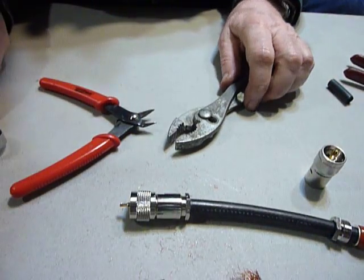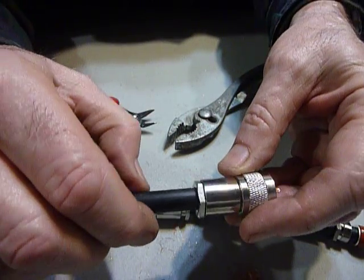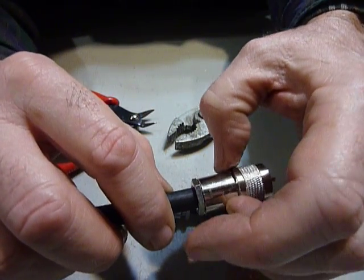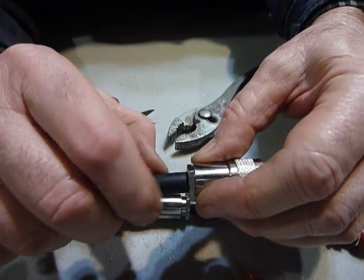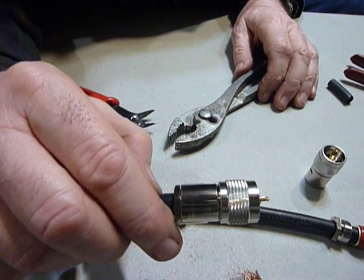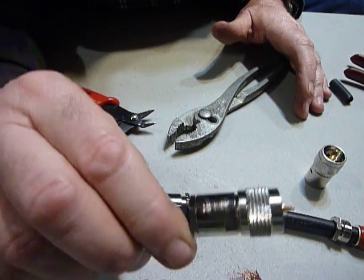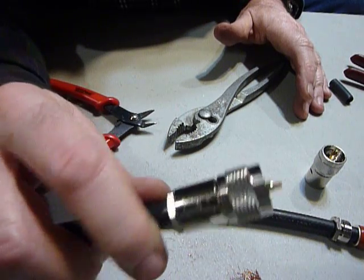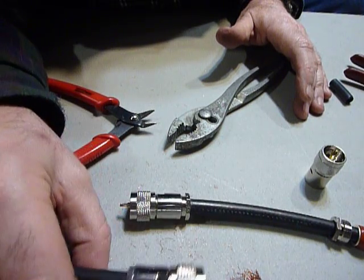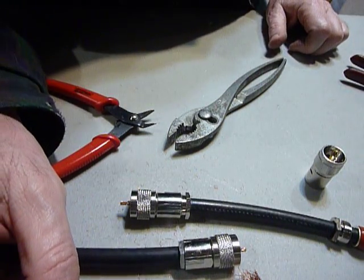Here's one that's completed - you can see little scratches here from the pliers I used, but I don't worry much about that. I'm going to try and find a thin 16 millimeter wrench, but so far I haven't found one - the pliers work okay and the little scratches don't bother me. So that's it, guys. I really think these connectors are great - there is no possibility of melting the center on these and causing a short circuit, and they are so easy to put on and take off once you do them a few times. 73s and good DX, I'll see you next time.